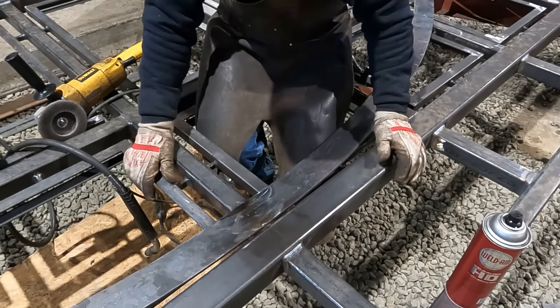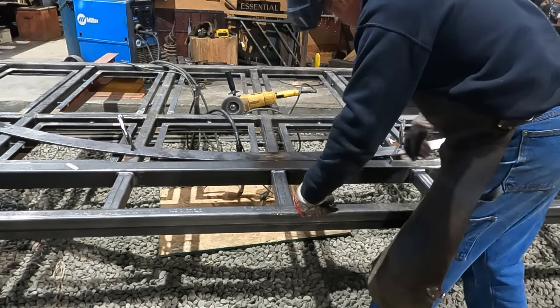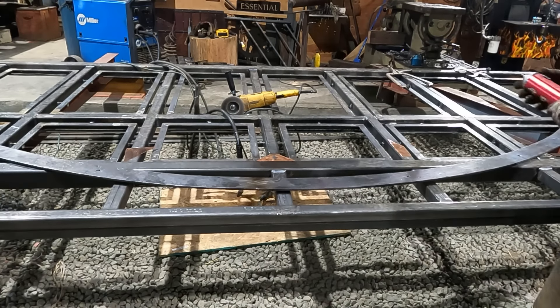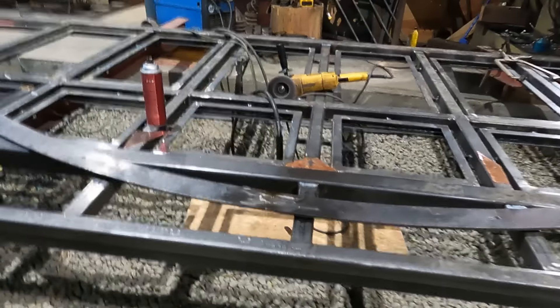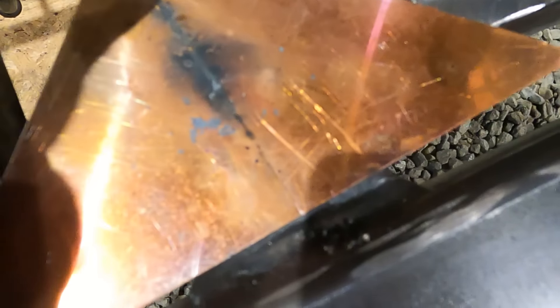I'm going to jerk that back up here, but I'm going to let that slack first. I think whatever movement's happened is all that's going to happen, so I'm going to pull it over here and clean this edge up. Here's what that copper plate looks like — looks like it might have stopped a little penetration and sticking right there. Barely heated it up there, so I probably have a little void on the back side I'm going to need to play with.